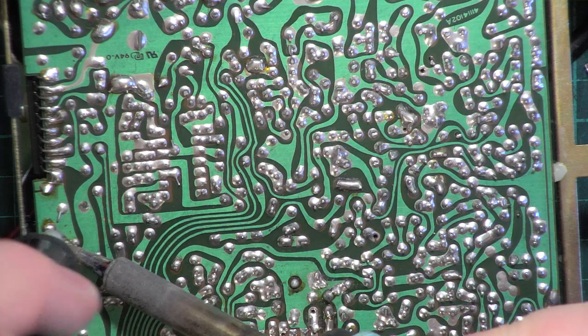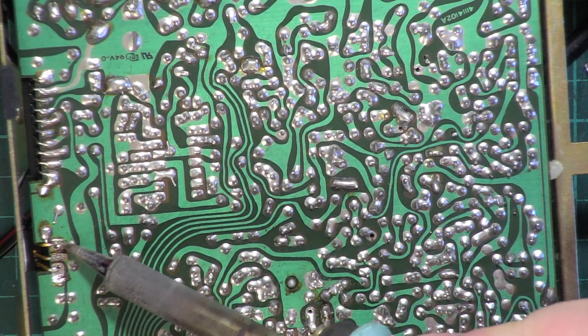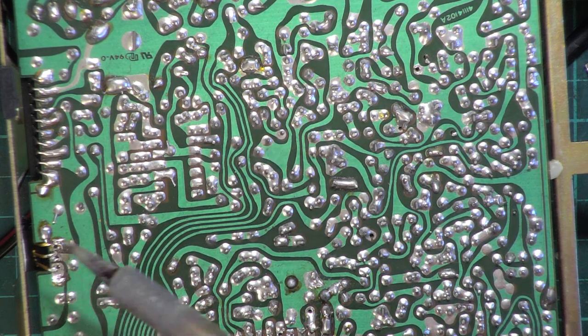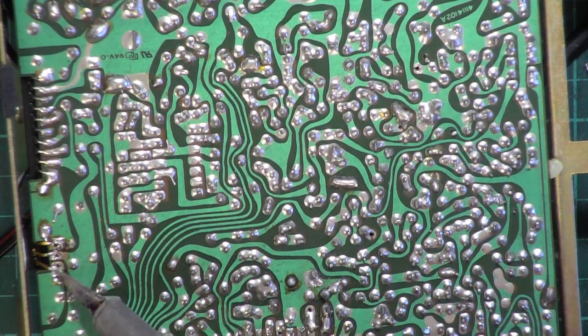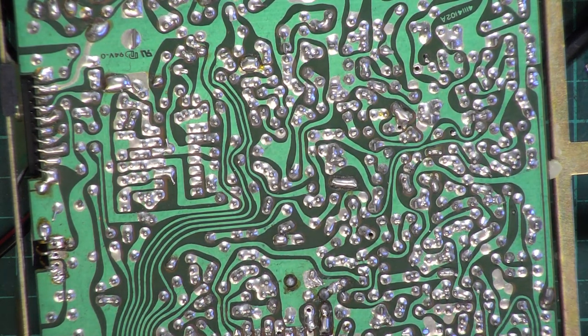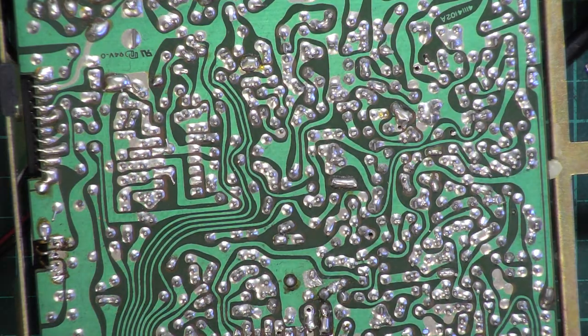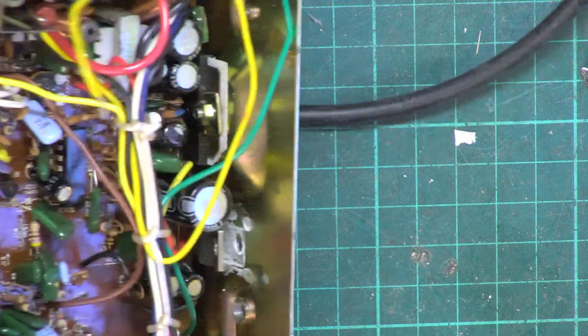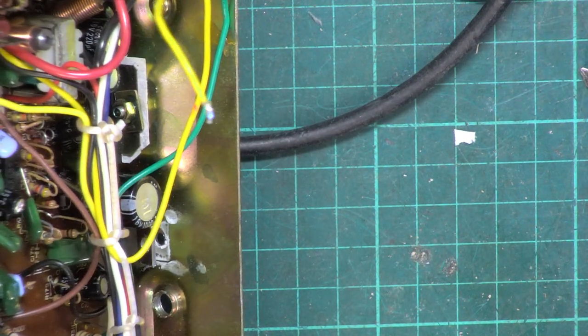I have known these go down, but usually they do go down and you've got no 8-volt rail. But you could have that intermittent thing. And as we say, it could also be one of the capacitors. So it's just a matter of doing a blanket job. All these kind of parts are so cheap anyway, it really doesn't matter. See whether we can... They're the wrong pliers.